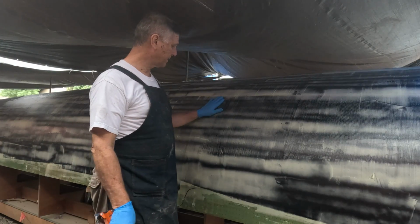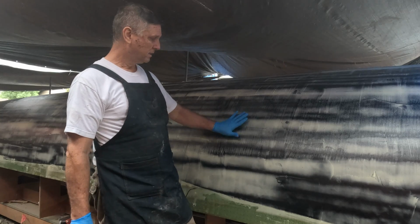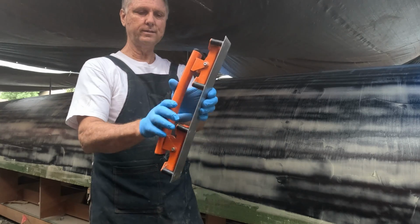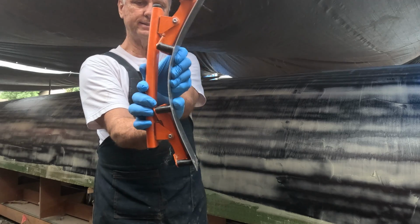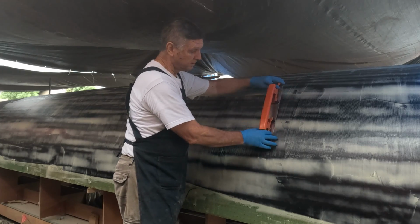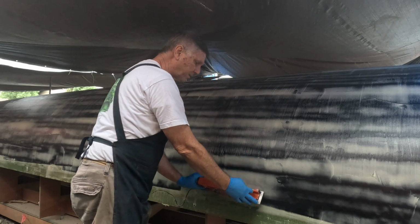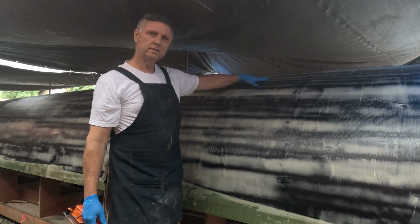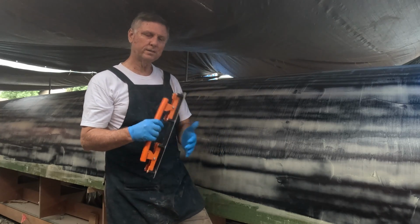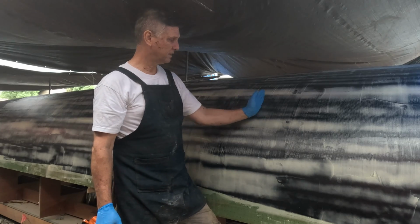Well, Brian and Garrett are mixing up the first batch for me in the back. I thought I'd take a moment to talk a little bit more about the technique we're using to put this on, because the only way this works is that these applicators here from FlexiSander flex. If you're using a hard flat surface, you really can't go on this because you can't match that round curve. Most of the time you'll see that with flat applicators, they're going to bring it down this direction, and they're going to put a thicker layer of fairing compound on, about 5 millimeters, and then use a notched trowel and put notches in it. So it's 5 millimeters high, but it's in grooves.